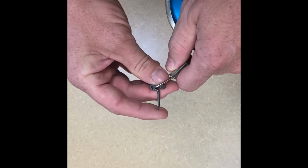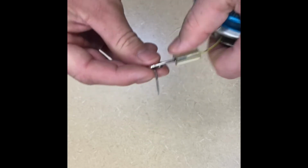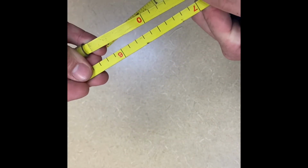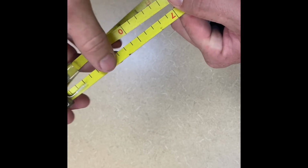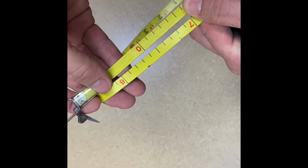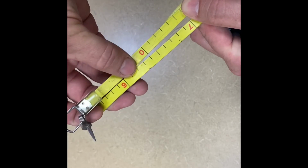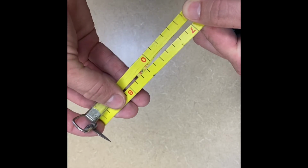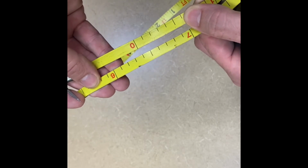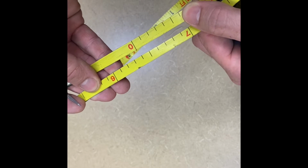It does have one little safety concern. That's going to be the tack that you actually use to stick into the tree. But all you would simply do is wrap it around the tree. And you come back and you look, and if you notice, you have a 6 and a 7. So this would be the actual diameter of the tree. This 0 would be the starting point. The way that we do this in the forest industry, instead of being to the exact 10th, for most practical applications, all you're going to do is go to whichever number it's closest to. So for this example here, it would be a 6.